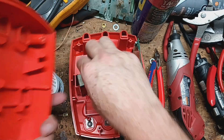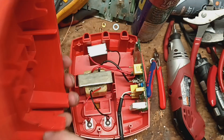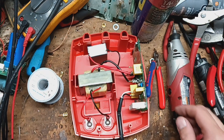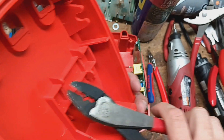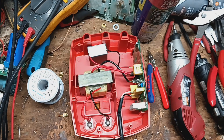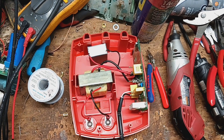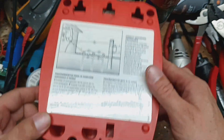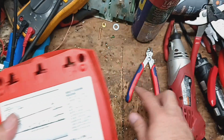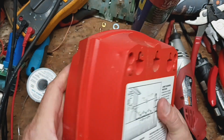This transformer is a little bit wider than the original one, so the case won't shut all the way — the transformer hits things on the inside. What we've got to do is take a pair of cutters and get these four little tabs right here — just snip them off, give them a little haircut. We've got all four of those snipped off. Now let's test fit things and make sure it closes. That should be good.